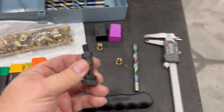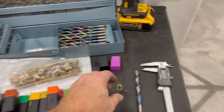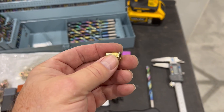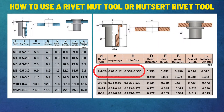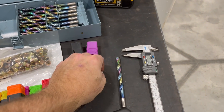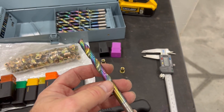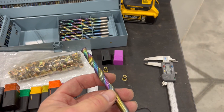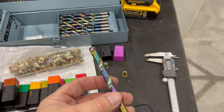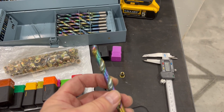Let's install this unit in here so we can set up to do the quarter 20. How do we determine the pilot hole for our nut rivet? If we take a look at the chart, these are the charts that you use to find your drill size. In this case, it says 351 to 356, so we're going to be using one drill size under 3/8ths, which is 23/64ths.